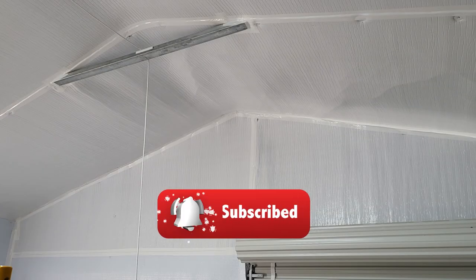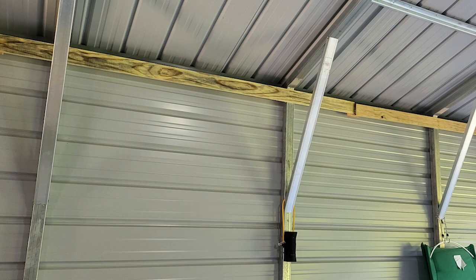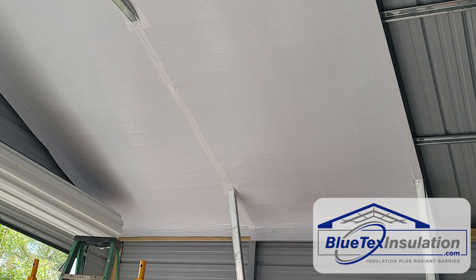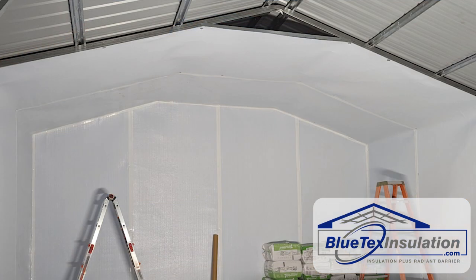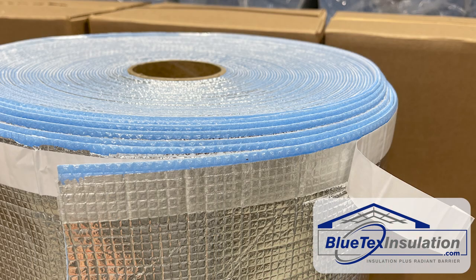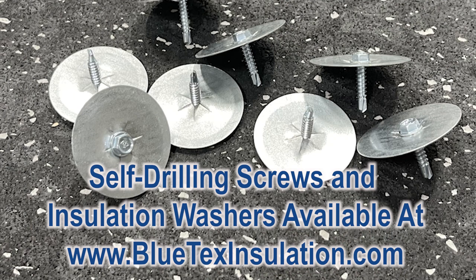For the roof, you want to start on one side on the 1x4 header, run it up and over, and terminate on the other wood 1x4 header. It's best to start on one side and if you can, take a couple of clamps to hold up the Blutex on the tubes. This way it stays out of your way and you can work from one side to the other. The Blutex will have the peel-and-stick double-sided tape on the back side of the foil, so attach that directly to the frame and use the frame to line it up on one side. Pull it across and just occasionally put a screw and washer to hold it into place.